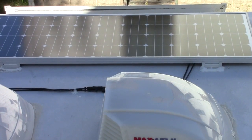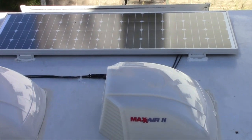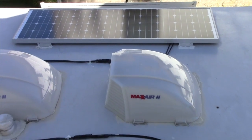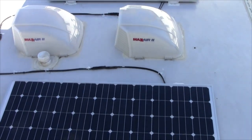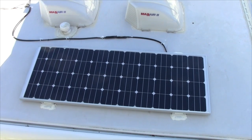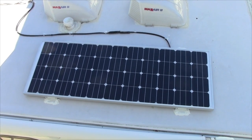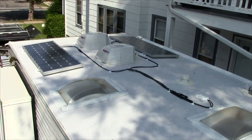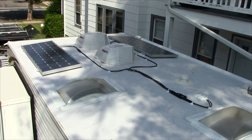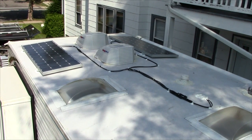Deciding on the size of a battery bank and solar system is an involved process which we don't have time to completely cover here. However, we can give you some points to consider, and there are links to more detailed solar education and solar sizing calculators in the description area of this YouTube video. To size the system, you have to know how much amperage you will be using. For the Green RV Project, we started with a basic design we could expand upon later, so considering your ideal and minimum requirements will be important.